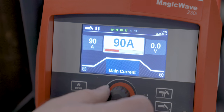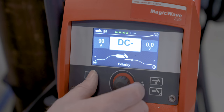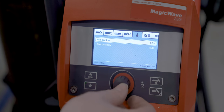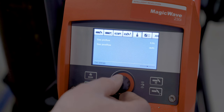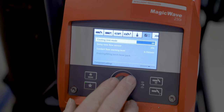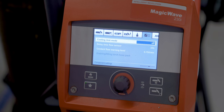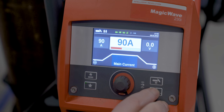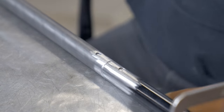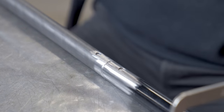I'm just going to put it at 90. Here's polarity — DC negative. Gas pre-flow: none. Gas post-flow: auto — we'll leave it there. Cooling unit mode. There's a gas flow button that makes it easy to set your gas. I believe I have it all set up. The only thing I'm not quite sure about is if the cooler is going to engage by itself or if I need to turn it on in the menu. I guess we'll find out.